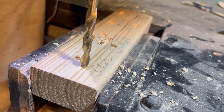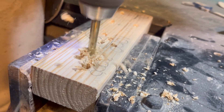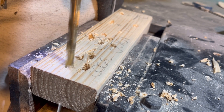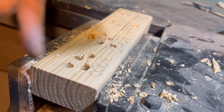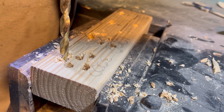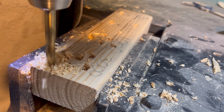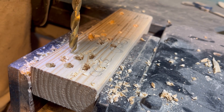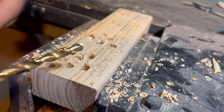That seems very comparable to the other ones. Let's really push it and see how fast we can get it - oops, maybe a bit too fast, got a lot of chip-out. Let's try to drill a nice hole at normal speed. We haven't got a lot of chip-out there - that looks quite good. The inside finish looks very good as well. Let's do another slow hole. Okay, that just chipped out straight away. We are getting some nice chips, and that's the cleanest hole yet. But I'm not really sure if it's worth it - it doesn't feel any sharper than when it comes off of the bench.